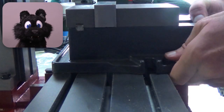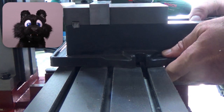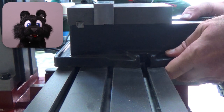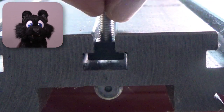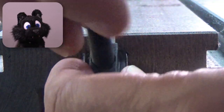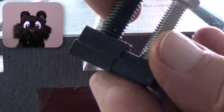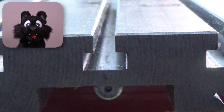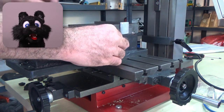Back to the mill. I also got the smallest mill bits I could find and — well, it is still too large, but will do in a pinch. And a pinch I got indeed! The set of T-nuts and hold-downs I have doesn't quite fit the T-slots. I was not aware that there are so many different sizes around — whoops! But good news: I shall shave off a bit of the T-nuts to make them fit. It's not like I'll ever clamp down something so hard that the nut would split. I had to tie down the vise a bit improvised with the T-nuts that came with the mill.